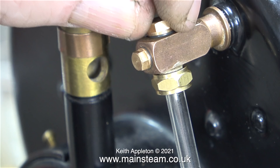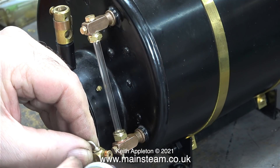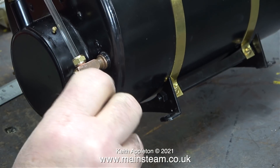When you fit water gauges it's really important to make sure that the glass is in the centre. I've shown how I do it in many previous videos. You can use a piece of steel bar the same size as the glass to centralise it, but I don't bother. I loosely fit the glass through the top nut, and then before putting the glass into the bottom nut, I move it around. Once it moves an equal amount left to right and front to back, I know it's exactly in the centre of the bottom fitting. A while back, a really irate viewer told me off for not using a piece of steel bar — and he typed his comment in capital letters with exclamation marks. The final part of fitting this water gauge is to use some Loctite 542 and then screw the draincock in place underneath the bottom fitting. I was lucky — it ended up being just where I wanted it, with the lever in the centre facing backwards.